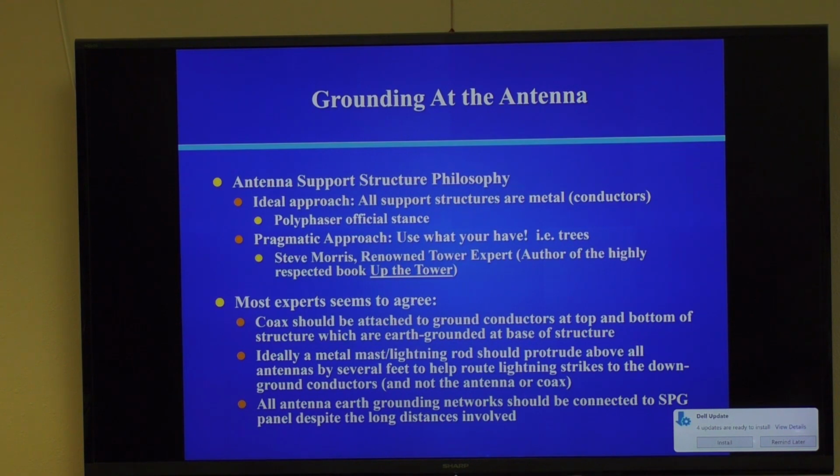You don't want to run ground wires if you can avoid it. Use strap. Yeah. Okay. Cadweld, that's what they call it. Exothermic. It looks cool. They need to expand their line and make something that's actually useful. Basically, it has a ceramic pot that goes around the top of the ground rod, and you bring the wire into it, and it fills the entire thing with melted copper. It just welds the whole thing, all in a matter of seconds. You've got to let it cool for a couple of minutes.